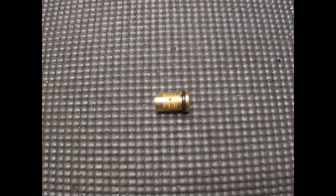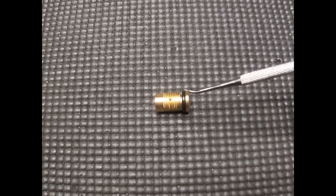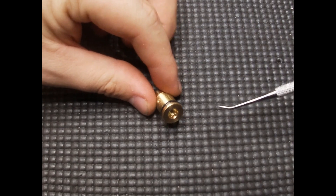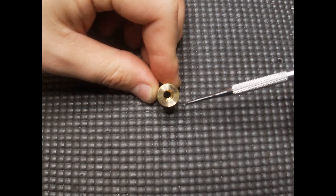Let's start with the leak areas. The first o-ring we will identify is the outer regulator housing o-ring. When this o-ring fails, it will leak out the top or face of the regulator. The leak will be around the outer rim of the face.